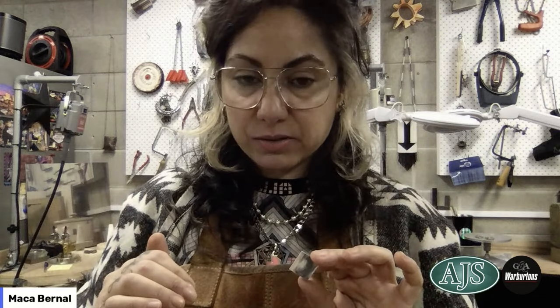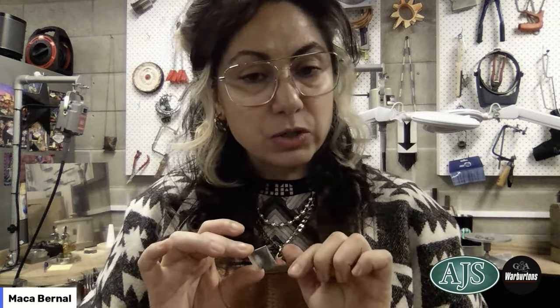This is sterling silver — you'll have to adjust your temperatures depending on the size of the piece and the metal you're working with, depending on its copper content. We're going to heat it up to 650 degrees seven to ten times: seven for smaller pieces, ten for bigger pieces, and if your piece is large and thick you might want to do this fifteen times.